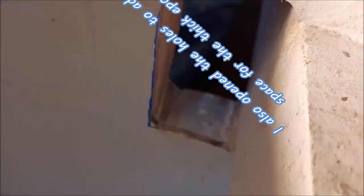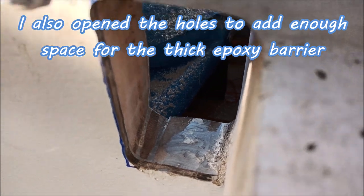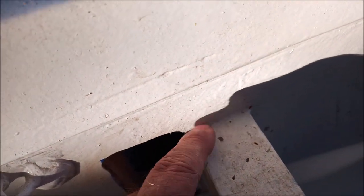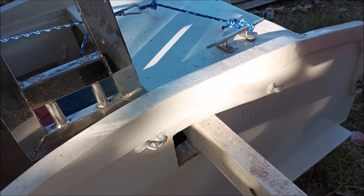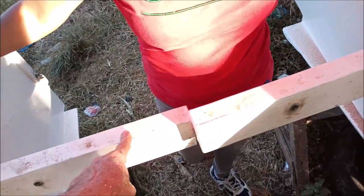On this one here, you can see on the inside there was some light coming in. Anyway, we got epoxy on the bottom and some of the top. This top here needs it too. This has got to be higher than the two-by-four because we're going to put about an eighth of an inch of epoxy — really epoxy these up nice and thick, because that's all the wear from sliding in and out.